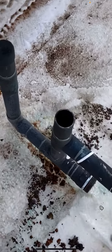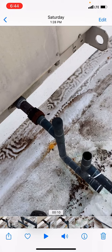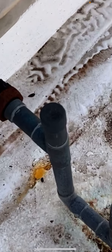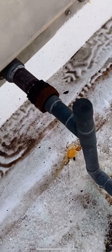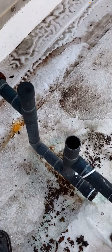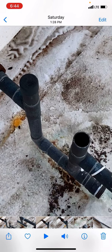But shop vac is usually most practical. So if I'm on a service call, that's my go-to. If I'm doing a PM, I already have a hose up there cleaning condenser coils or evaporator coils, like in this case. Really, I'm just going to use the hose, which I think is the best way to really get all the stuff out of there anyway.